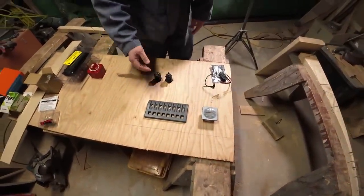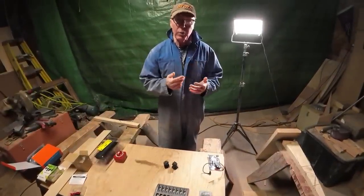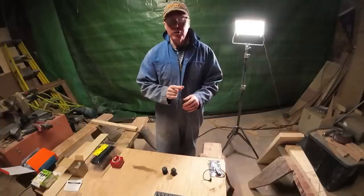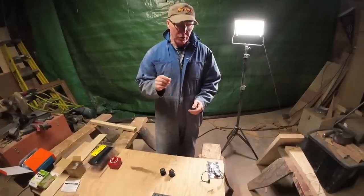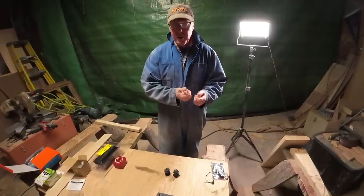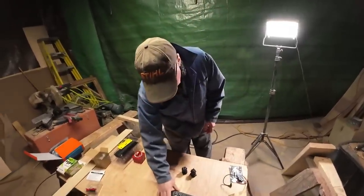And they all have the blade style fuse, which are really easy to get. And that was one of the decisions we went through. What type of fuse do we want to put in this stuff? Well, the blade fuses, you can get them just about anywhere. They're used in automotives, they're used on panels like this. Because of that, and they're inexpensive, I can just put a few into a bag, suck the air out of the bag and put them in storage, and if I lose a fuse, it'd be very easy to replace. So that's the fuse panel.